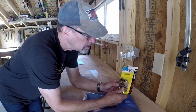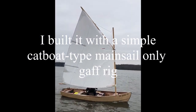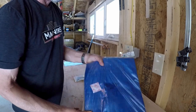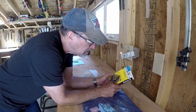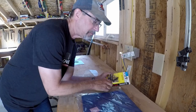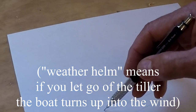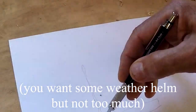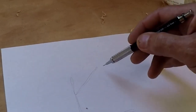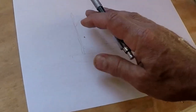One experiment I'm thinking of making with a minimal money investment is a jib on Grace. Tie a block up through the masthead, run a halyard through that, and make a temporary jib out of this sheet. Put some grommets in it and that'll actually be a pattern if I want to order a real jib. The reason for doing that is a little bit less weather helm on Grace — the rig is called a cat boat rig where the mast is fairly far forward and gaff rigged, so the center of effort for that sail is pretty far back.